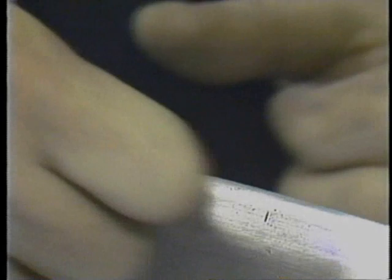Once the sandpapering has been completed, it is then necessary to dye penetrant inspect the area to see that all traces of crack or damage have been removed. Once this process has been completed, it is necessary to cover the area that has been polished with some type of alodine or polyurethane paint. As you observe, this nick has now been completely removed and prepared for either paint or alodine treatment.